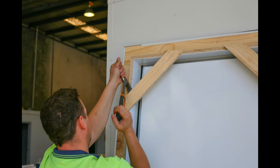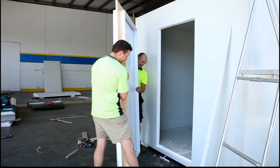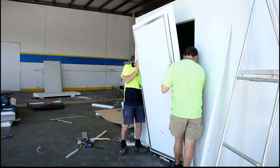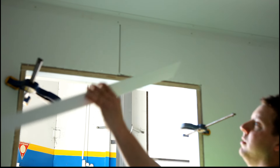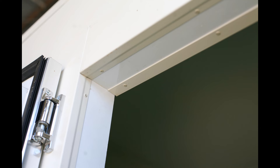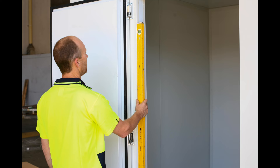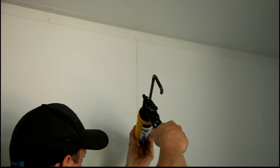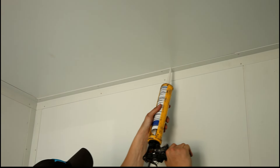Remove the wooden bracing and all the nails from the door. Next, we need to fit the door and clamp to the wall. Measure, cut, seal and fit the internal angles to the internal side of the door, ensuring the door is tightly home and no gap is apparent. Check all levels. Seal all the internal gaps at this point.